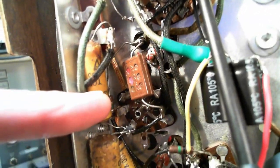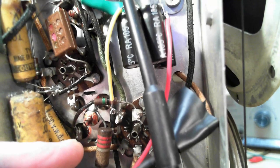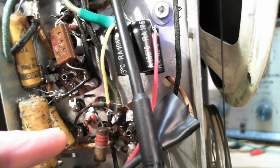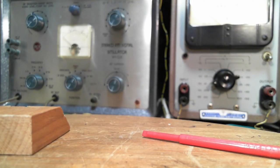It's in absolutely the correct position - see how one leg of this resistor goes up and connects into one of the IFs and the other leg comes down and connects into the other IF. That's pretty certain. We should be able to spot that on the schematic quite easily, which we're going to do on the computer screen. I think a really good place to hook up my voltmeter is right between these two resistors, and when we look at the schematic it'll become apparent why.